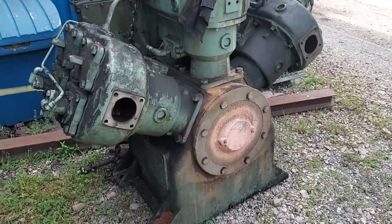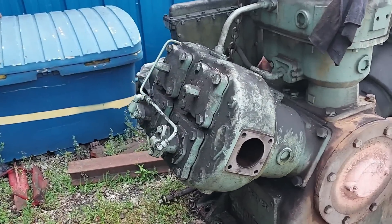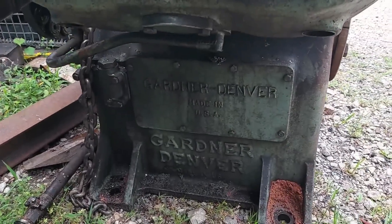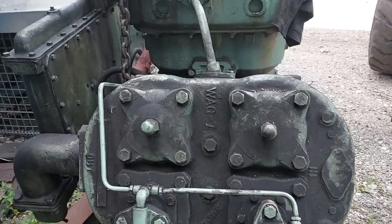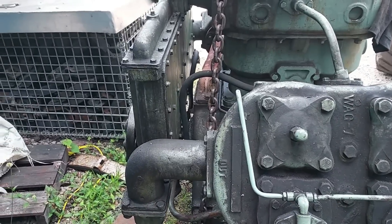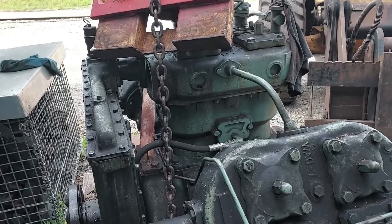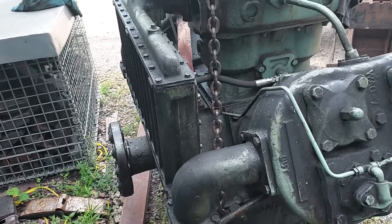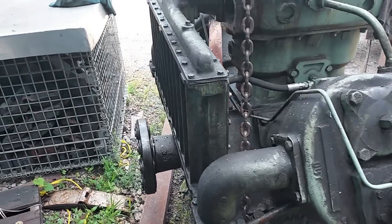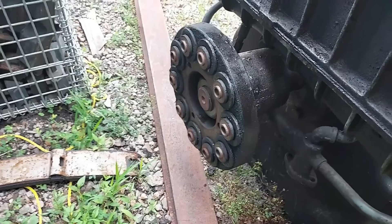I'll turn around here and show you what's going on. We got it out. The mechanics this morning unbolted it, and this is the air compressor — Gardner Denver, made in USA. We don't know if this is original equipment in number 22 or not, but yesterday when 22 was on the head end of a loaded coal train, the operator was doing his pre-op up at the loadout after he had loaded all the cars, came back here and this was putting out some significant amount of smoke. It did hold up enough to bring it back. He did come down on a self-imposed slow order on the train in case he lost air, but it did keep the main reservoir air pressure up the whole trip back.